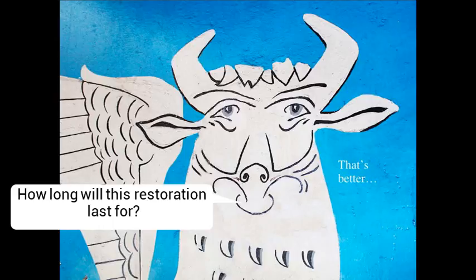The areas which are really salt damaged at the moment — we're hoping to clear those areas of all material. We would look to remove the paint that's been destroyed on the surface; it might still be there in little bits but it's beyond saving. We'll remove that, try to take the salts out, and clear the zone as far as possible of the salt-laden damaged area. In terms of removing the gypsum — pretty much, yes — the idea is to get the brick exposed a bit. You can't remove it completely because the pointing in the bricks has got cement in it, and the cement contains salt, so the salt is in the building. Gypsum plaster is itself a salt. You have all these things going on, so it's never a straightforward answer, but we're going to try to choose materials which are as stable as we can get them to do what we can to stabilise the original material.